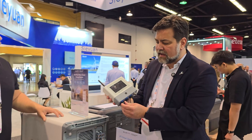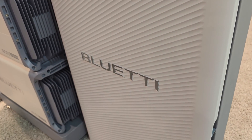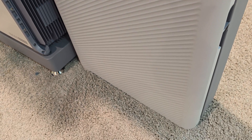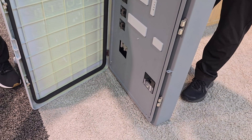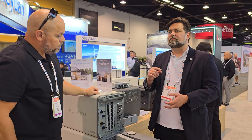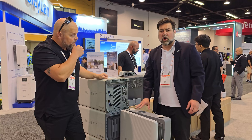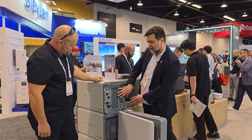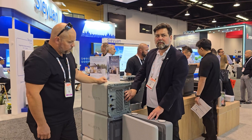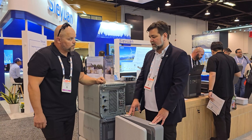You can parallel three of these together. For larger installations, we also have an ATS — this is a prototype — and essentially what this is, is where we'll have the ability to have intelligent load shedding. It has the 200-amp pass-through and the ability to have each unit interface into it. You can add a generator, add existing solar. This would be what we call the MID device — the microgrid interactive device. It's for a more sophisticated microgrid where you have a separate generator, existing solar, and multiple units.